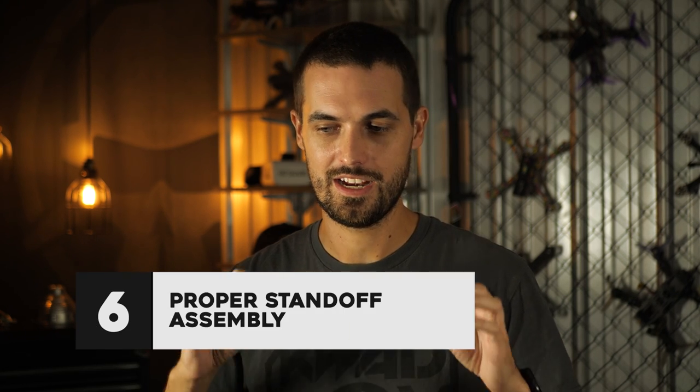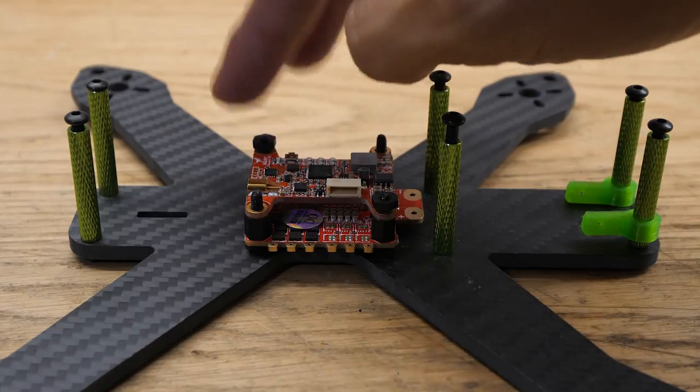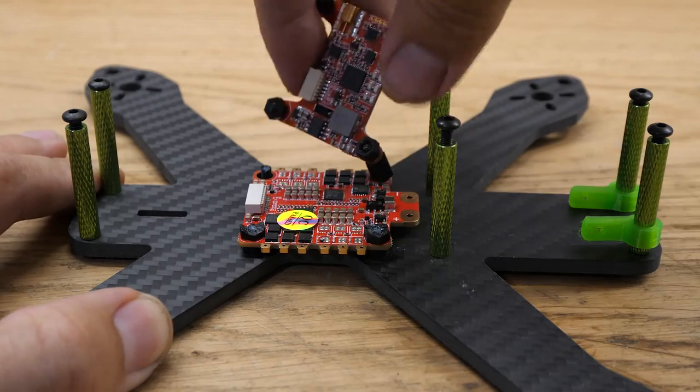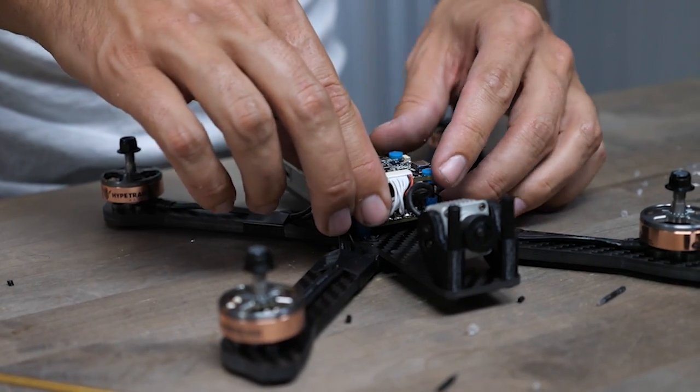We've talked about the outside — arms, batteries, antennas, cameras — but what about the inside? One of the most overlooked things is how the electronics stack is mounted. Many stacks come with nylon standoffs, but those threaded nylon stems are so fragile — your stack ends up flopping around because the stem breaks off the standoff. I highly recommend using nylon standoffs that are just a threaded hole all the way through, with one long metal screw running bottom to top. Thread standoffs down onto it, place your boards, add another standoff, place the next board, and put a nut on top. With this method, your stack is never going to break.